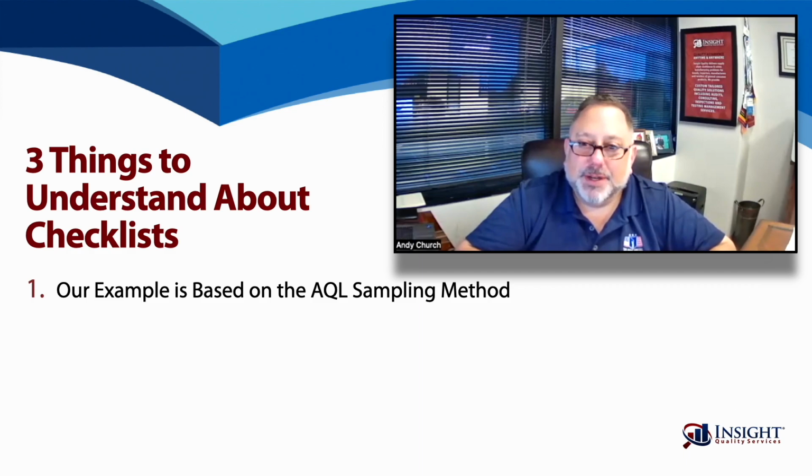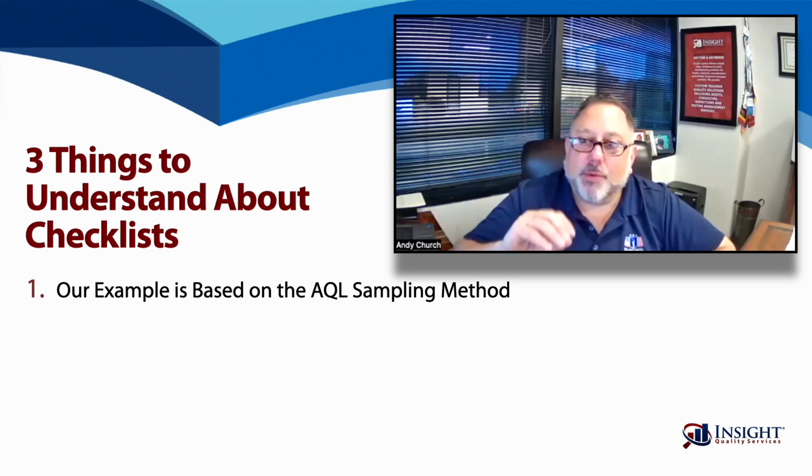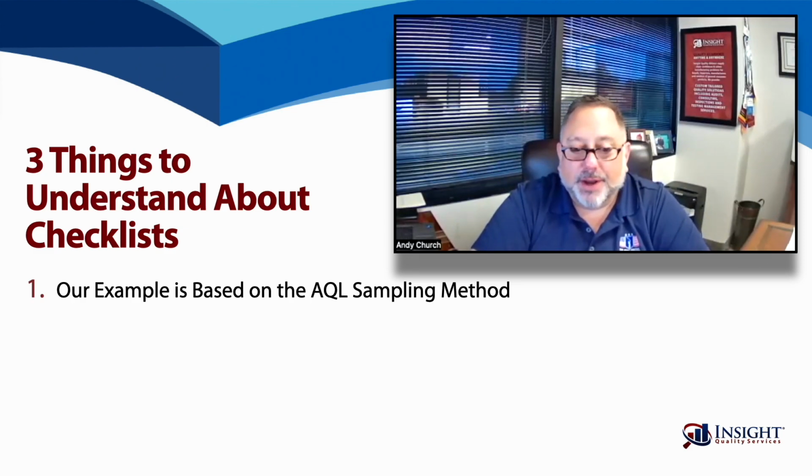In general consumer goods, such as coffee mugs, ready to assemble furniture, apparel, there's going to be defects in a manufacturing lot. It's unlike automotive or aerospace components and products, which have to be 6 Sigma, 0 defects. It's important to recognize there's going to be some defects in a shipment. So what's the worst tolerable you're willing to accept? And a sampling methodology such as AQL is a proven methodology that can be used to extrapolate the findings of a sample to the entire lot. Absolutely. So it's important to incorporate into the checklist what your AQLs are.